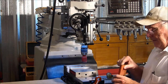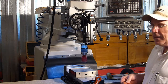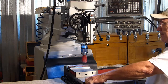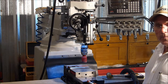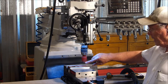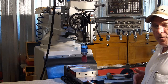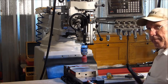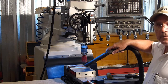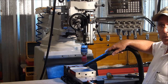This is our stock. It's half inch thick — a piece of steel off an old International Harvester cultivator, and we're going to sacrifice it today to make a hole in it. The secret to drilling or sawing a hole in metal is slow speed, steady pressure, and we have to have some way to get rid of the chips that the hole saw cuts and at the same time cool it. What I use for that is just a plain shop vac, and I put it right at the intersection of the saw and the workpiece. That does two things: the airflow cools the saw and it also removes the chips.